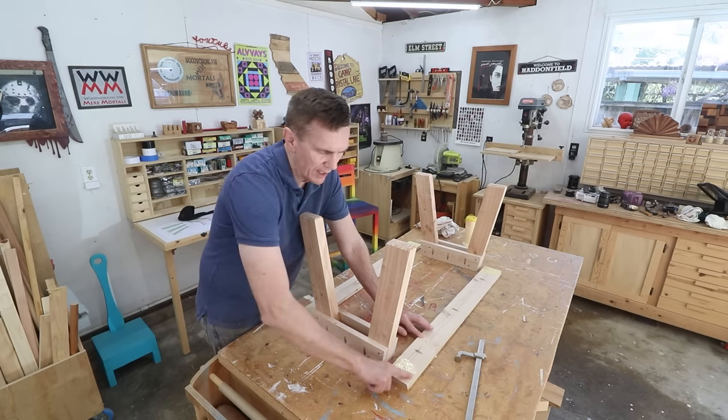Without doubt, the most protective coating you can give to any outdoor project is paint. A good exterior house paint will last for years. You can use clear outdoor stains or sealers, but you'll have to reapply those every year or two. And eventually the wood is just going to gray out anyway.